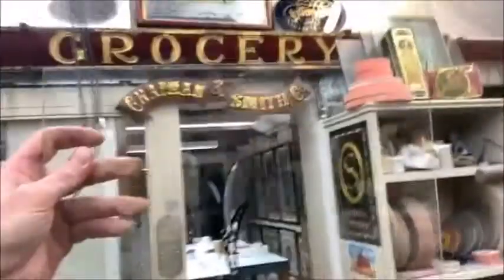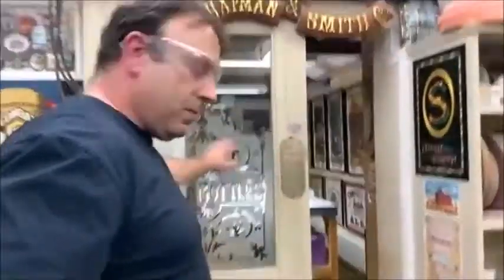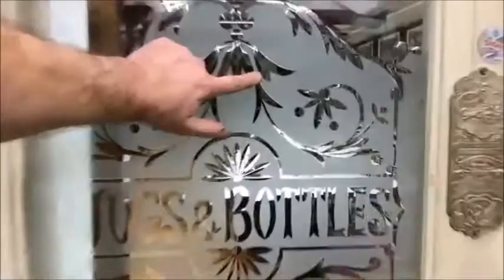You're left with a nice smooth finish, and you've got to take care of both edges. So there we go — I'd be happy with that. You can actually see through it because the water's there, but when it's dry it goes to a frosted, sandblasted finish. The depth of it is probably about one and a half mil. From there I'd MDF wheel it with a polish and then the felt, and it'll be clear. Then you'd have a nice cut glass piece — when you look through it you get this nice clear glass ground finish.